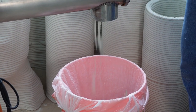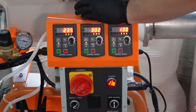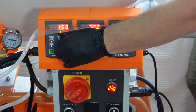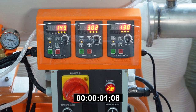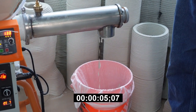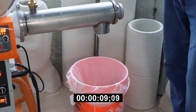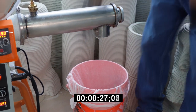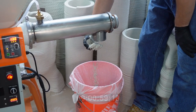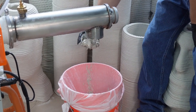For a one-part cement that does not use accelerant injection, you need to reduce the water content. Here we are reducing the water amount to 150 rpm and we are not changing the powder amount. After making changes to the water or powder motor speed, it can take up to one minute to see changes in the material coming out. The material that is coming out now is ideal for printing as a one-part cement with no accelerant.